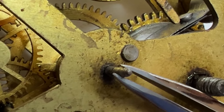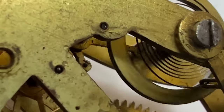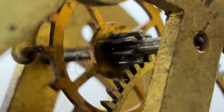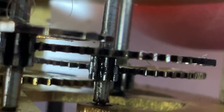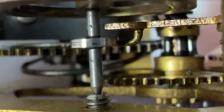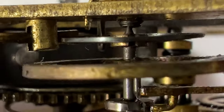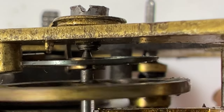There's a small amount of movement here but not enough to stop the clock. There are punch marks here where someone used a punch to adjust the side shake on the escape wheel pivot, and additional punch marks where someone adjusted this pivot — could use a couple of bushings. The gear teeth and pinions on this movement are full of oil, which can collect dust and eventually stop a movement. That hair has wound completely around the escape wheel arbor. The balance staff is rocking and doesn't appear to be rotating on its center. This balance cone bearing has a crack in it; we'll need to remove the balance to see if it's a problem. The balance wheel is bent and the balance staff isn't running on its center — no wonder the customer was having trouble keeping it running.